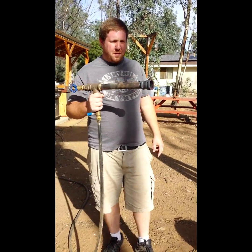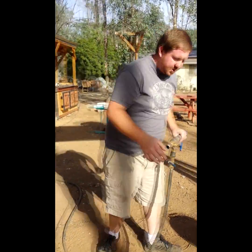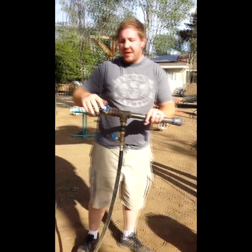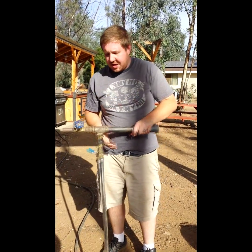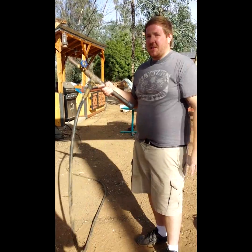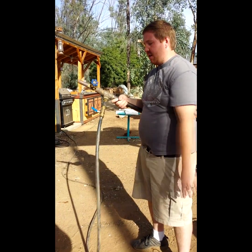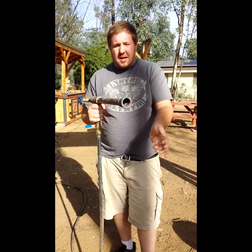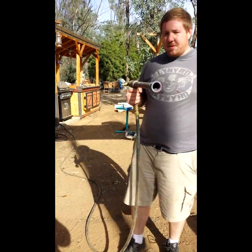New and improved foundry burner — it gets a lot hotter than the old one. I've got a three-quarter inch pipe nipple that the hose from my shop vac goes over, and I use that as a blower. This valve here controls the airflow. Then it goes into a one-inch T that I use as a mixing chamber for the gas hose. I was originally using a three-eighths inch air compressor hose but that wasn't giving me enough gas, so now I'm using a three-quarter inch garden hose going into this valve to regulate the flow. Then it goes through a one-inch tube into a nozzle — a one-inch to one-and-a-quarter inch black iron pipe reducer — that I stick through a hole on the side of the foundry.